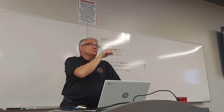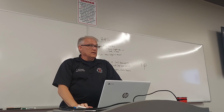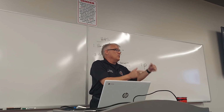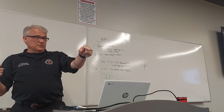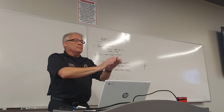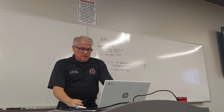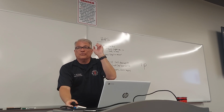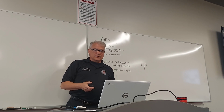But be careful, because you said adjust. Sprinkler heads are not adjustable. Okay, we sell a variety of them, 150, 155, 160, 165. Based on your hazard, we can give you whatever you want. But there are not adjustments on sprinkler heads. All right, so color, frame arm, or stamped for the sprinkler ratings when they go off.